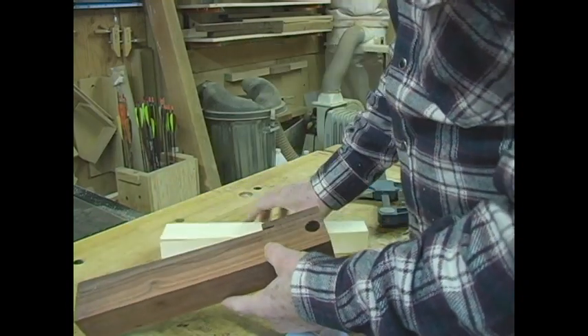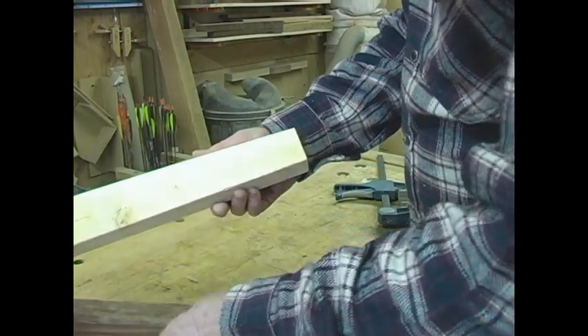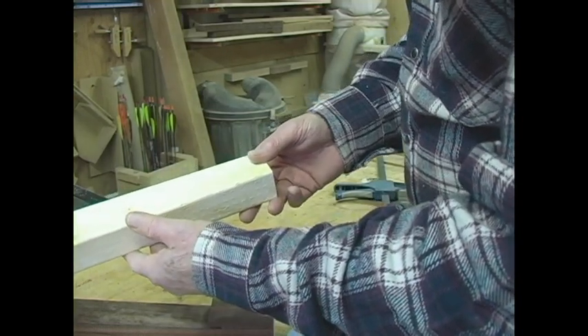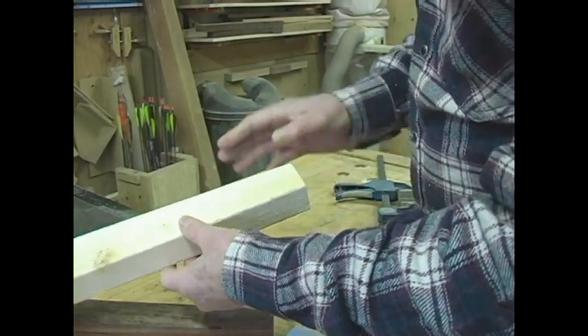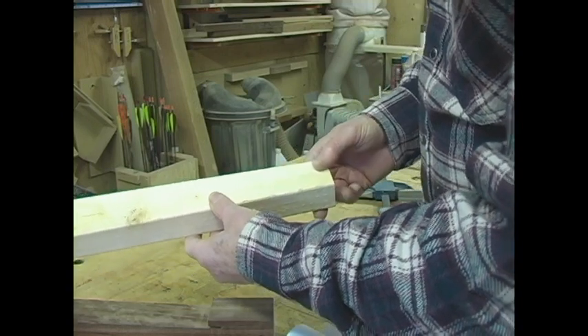There's your seven-degree angle. This is a standard jig and I made it all out of one piece, but it's actually better and a lot easier if you do it out of two. So we have our angle here, as you can see. All we're going to do is put a block on here as the driver so in the future we can cut all the seven-degree angles we want and we don't have to use double-sided tape. We're going to glue that in place.